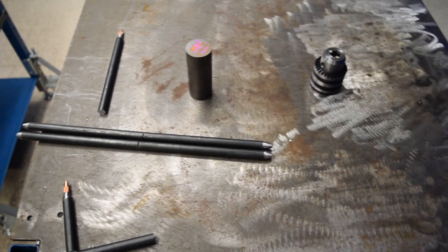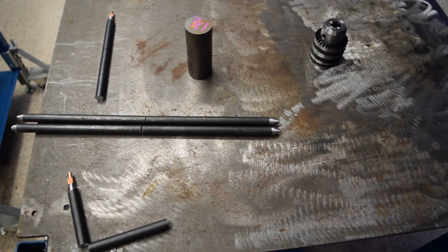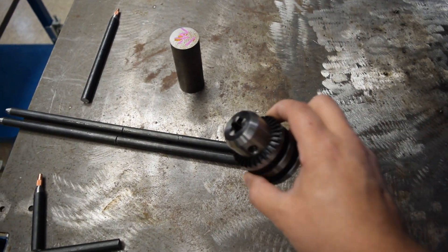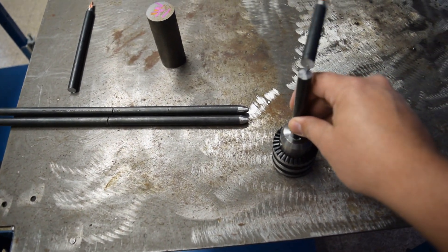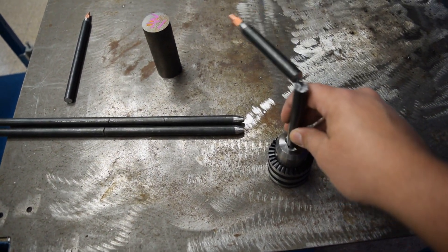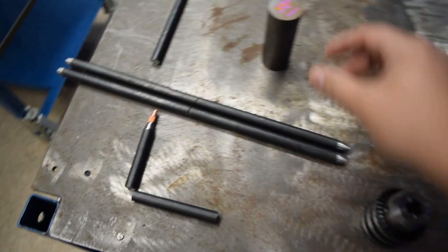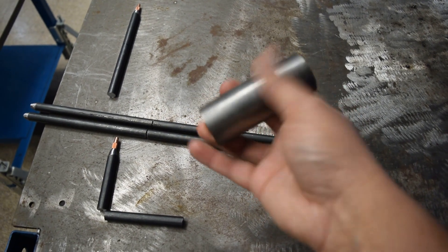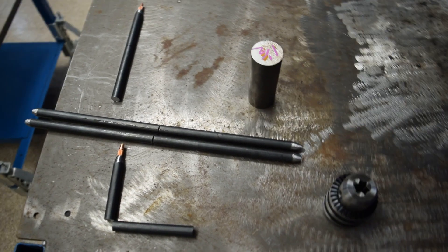When it comes to building your third hand tool there's a few ways you can go about it. I'm going to make two versions: one using a chuck as the base so we can change the size of the head that sticks out — a shorter or longer one for specialized jobs where we might need that extra reach — and then one using a one-and-a-half inch diameter, four-inch long solid round as the mass in the middle to give some weight.